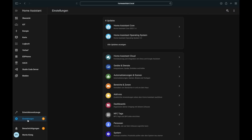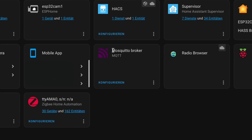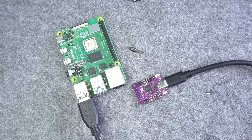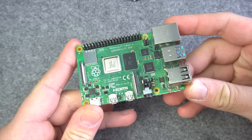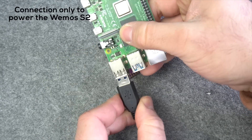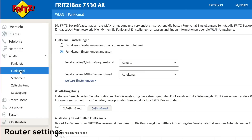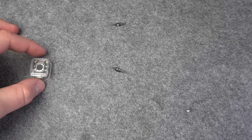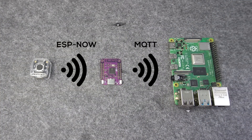Of course you can use the PicoClick directly with MQTT, but the WiFi connection process takes longer than my preferred way using ESPNOW. To do so, you will need an ESPNOW to MQTT bridge next to your running Home Assistant server. In my case, I am using a Raspberry Pi for the server and a Wemos S2 Mini for the bridge. The bridge can be set up using a single ESP device — the only thing you have to set up is that it uses a fixed WiFi channel, channel 1. The bridge is then able to receive the ESPNOW messages from the PicoClick and forward them as MQTT messages to the server.